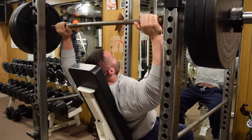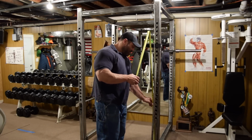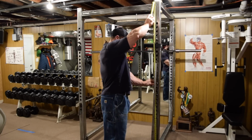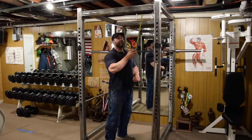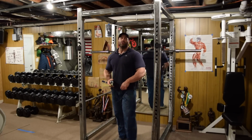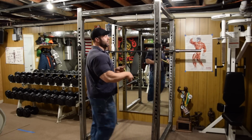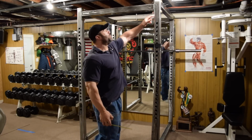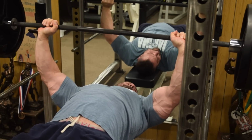It's solid. If we were making a list of material that you would need for this job, for the 3x3 square tubing, you would need 4 pieces that are 84 inches or 7 feet long, right? For the 4 uprights, 1, 2, 3, 4. All of these are 42 inches, 1, 2, 3, 4, 5, 6 pieces, all 42 inches long. But this rack, front to back, is 48 inches on the dot. Side to side, the width is 48 and a half, because of the 1/4 inch plates. Kick it out another 1/2 inch. And that's the material for the rack in terms of the list of steel that you would need.